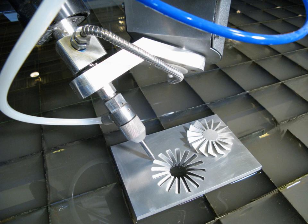High pressure vessels and pumps became affordable and reliable with the advent of steam power. By the mid-1800s, steam locomotives were common and the first efficient steam-driven fire engine was operational. By the turn of the century, high-pressure reliability improved, with locomotive research leading to a six-fold increase in boiler pressure, some reaching 1,600 psi. Most high-pressure pumps at this time, though, operated around 500–800 psi.